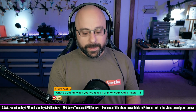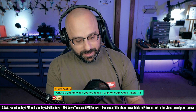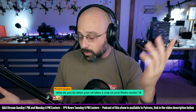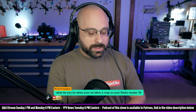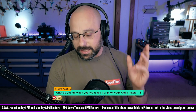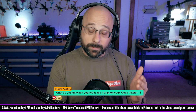So when you get a new radio, one of the first things I do is take the SD card out, copy the contents to a new good quality SD card. It doesn't have to be a big 64 or 128 gig — it could be just two or four gig. Nobody makes a two gig SD card anymore except for the cheap 3-cent ones they put in radios. Just get a name brand SD card for 10 or 15 dollars, put it in your radio, and throw out the one that came with it the day you get it. It probably is trash and it's probably going to die on you.